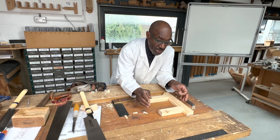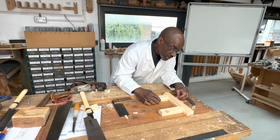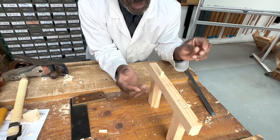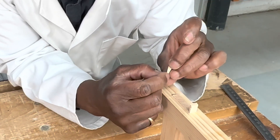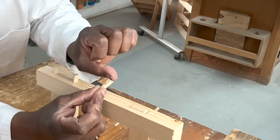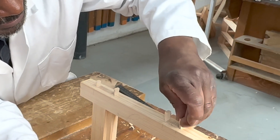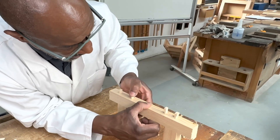So now the wedges — once this is glued up, the wedges will sit here. The flat side, or the 90-degree side of the wedge, will sit on the flat of that edge of the tenon. On this one, the 90-degree to the flat goes in here. The next one, the 90-degree from the square sits here. And then this one — which is bigger, but it will still work — the 90-degree end sits in here like that. That's how that works. So temporarily, I'll keep those in here until I'm ready to glue this up, so each one can go in just for now.